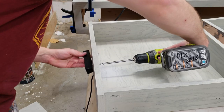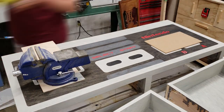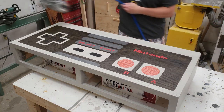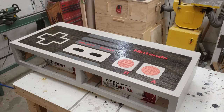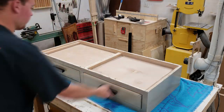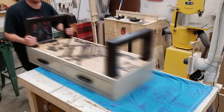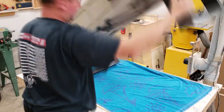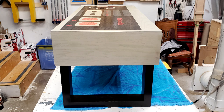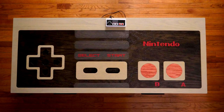While the glue was drying, I attached the two drawer handles and got everything ready for polyurethane. After removing the weights from the top and admiring the result, I applied three coats of water-based polyurethane semi-gloss, sanding lightly between each coat except for the final one. After letting it cure for about three days, I began final assembly — drawers first, then the legs placed on top and screwed down with the existing holes. With that last screw in place, the table was flipped over and is now complete.